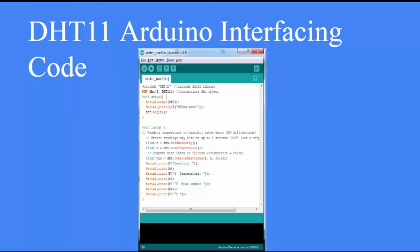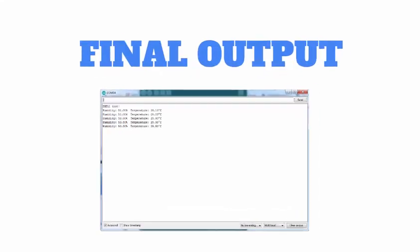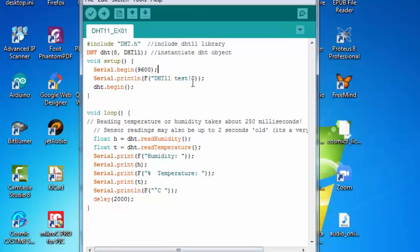You cannot monitor very fast values since each reading takes approximately 250 milliseconds and you need to wait 2 seconds before reading the next value. If you want to see the output, it will show something like this. Let's go back to the terminal and see everything in real action. Here is the code for the DHT11 — I have included the DHT.h header file and instantiated on pin 8 of the Arduino, and started the serial console.